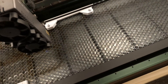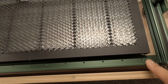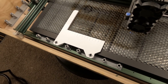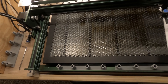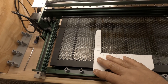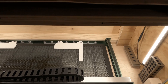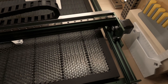Another great touch is these threaded holes that are equally spaced on both of the x-axis frames — threaded for four millimeter screws. So I was able to design a locating system here for these plates, which helped me quickly get things squared up. They're located up at the top as well, so I can mount my squares and standoffs directly to the frame for easier squaring and locating of parts.